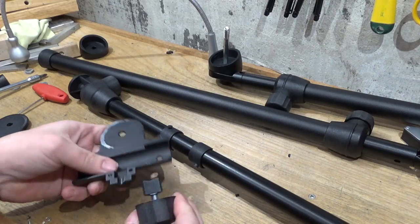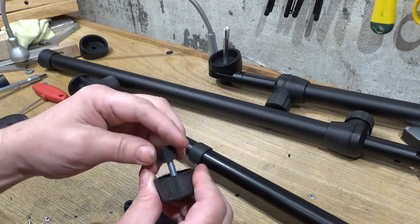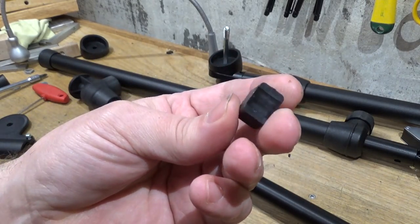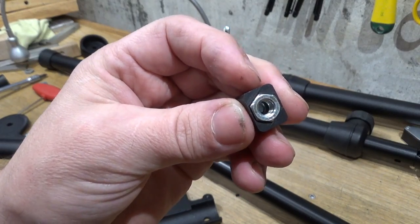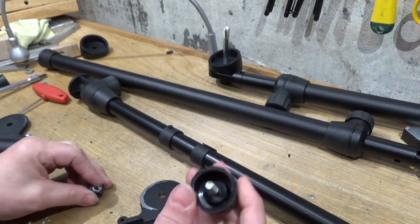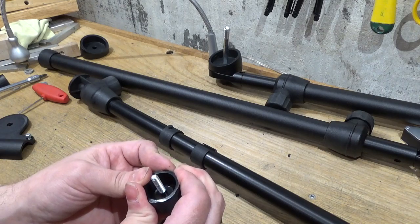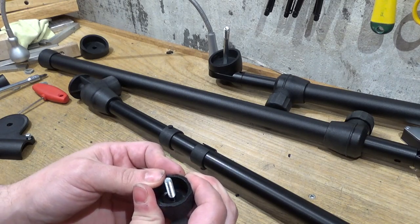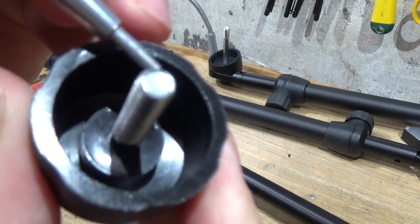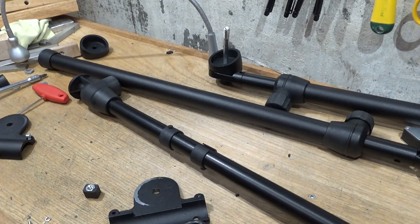And there we have it. That's Delrin, I'm pretty sure — and just a standard nut, easy enough to replace. Again, not stainless. The plastic seems to be solid, but I can squish it a little bit though — it has some give, so I'm not sure it's glass-filled. Taking a carbide scribe just to check that out: if it was glass-filled, I would expect scrunchiness as I'm passing the scribe along.